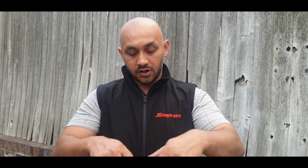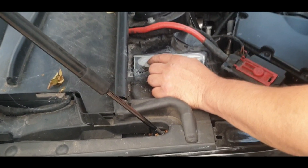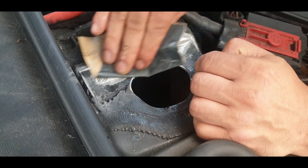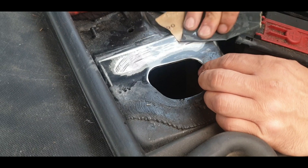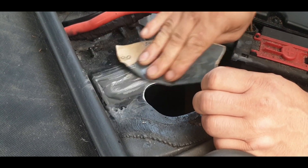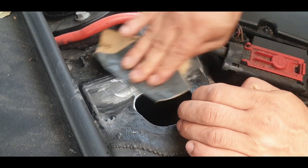I've got some P600 wet and dry sandpaper. I'm just going to take a bit, put it in my bucket and make it wet. See, all of these grinder marks have gone a little deep inside, so I'm just going to try to flatten it down as much as it would go. Before I go into the next stage, I just want to make it as flat as possible all around here. I'm going to try to take it away as much as possible — make it as flat as possible. I'm not using anything rough, just something smooth, because I don't want to make any more marks than it's already got.